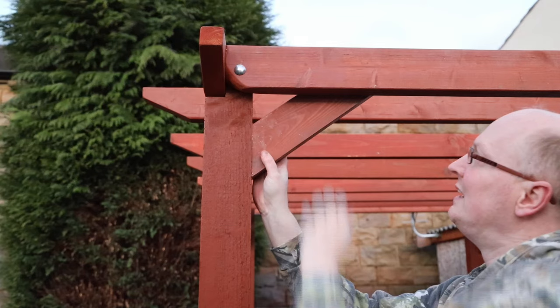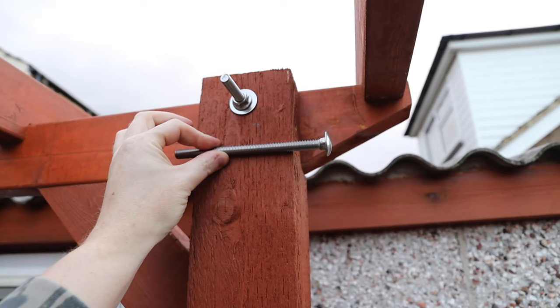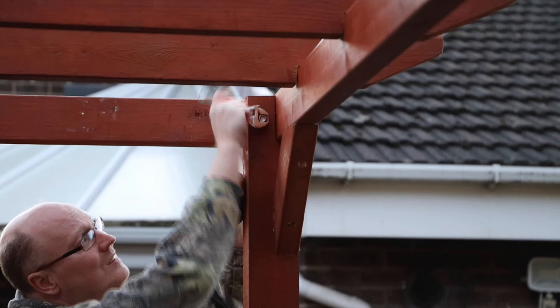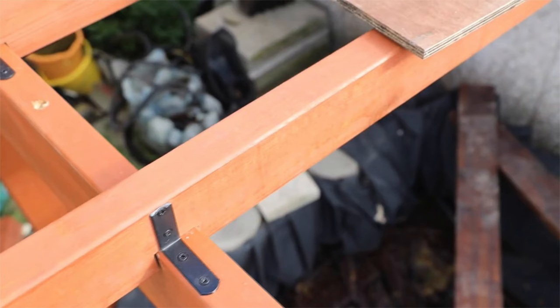Here's a brace — cut at a 45-degree angle and screwed in tightly. I'm just showing you the long bolt that goes through the actual post and we're just tightening those bolts — they're about 60mm long. You can see me with pliers and a spanner there tightening. I also realised that I need to adjust the height of the roof.